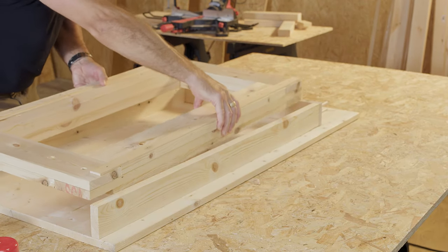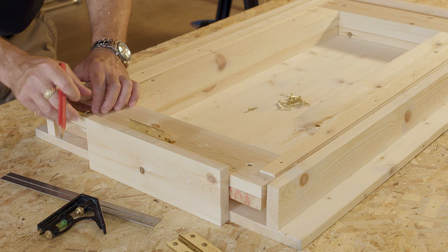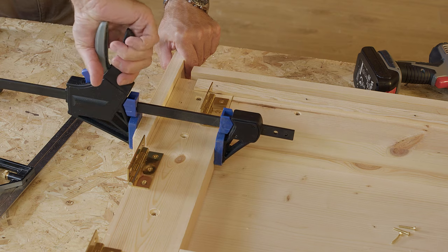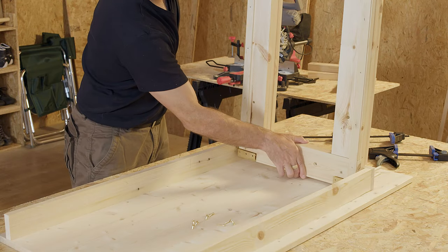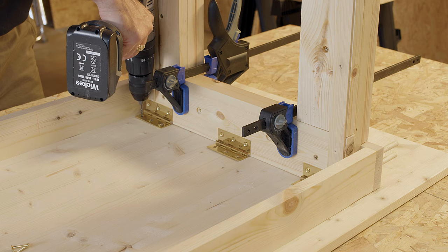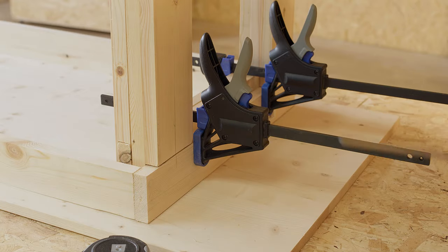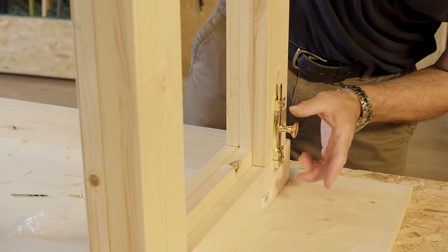Lay the table top on your workbench and position the drop-down leg inside. Place the butt hinges in position so that they're flush with the end of the drop-down leg. Hold a timber off-cut against the end and position the top part of the hinge so that it's sat at 90 degrees. Mark the holes of each hinge, drill your pilot holes, and clamp your off-cut into position when screwing in the hinges to make sure they're sitting at a right angle. Stand the leg in its final position at the end of the table top. Check that there's a pencil-width gap either side before clamping it into an upright position. Drill pilot holes and screw in the other side of the hinges. Saw off the excess length of your dowels and sand them smooth. Clamp the leg back into an upright position and trace lines along the centre of each leg that carry onto the framework slightly — this gives you the position for both parts of your deadbolts — then screw them into place.